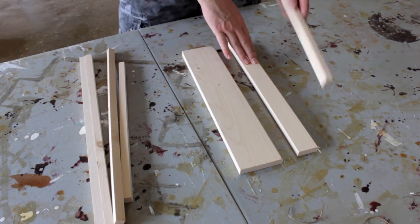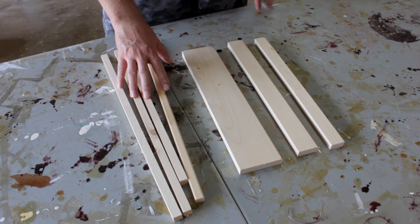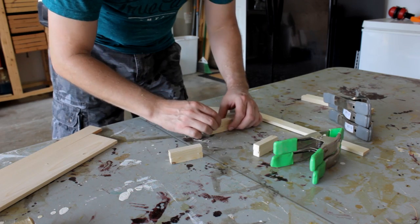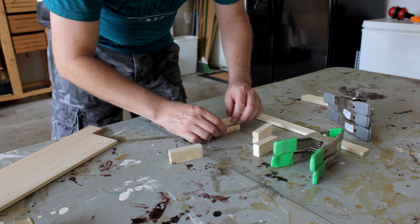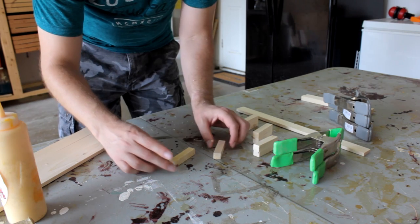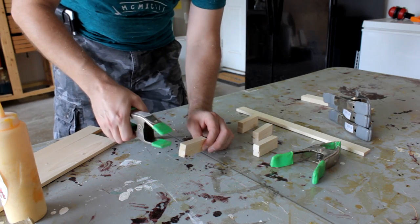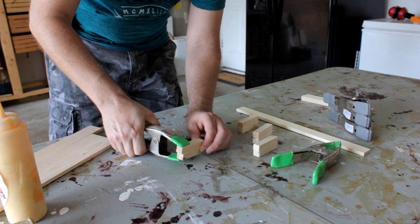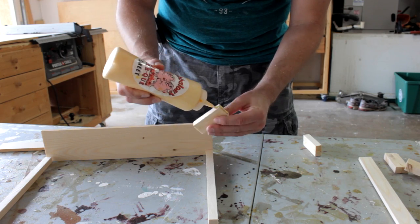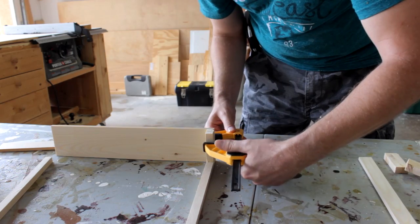Here are my three main pieces, and then these get cut down even further and glued together to provide my connector pieces. I'm going to use simple butt joints to assemble this, but there are a myriad of joints that could be used. If you're not comfortable with the strength of a butt joint because you plan on doing chin-ups or some other thing, you can simply add quarter-inch dowels to wherever it is that you see fit.